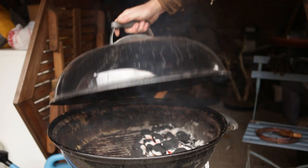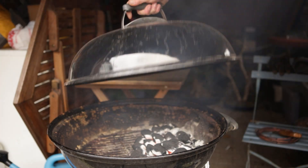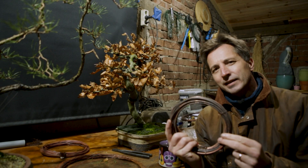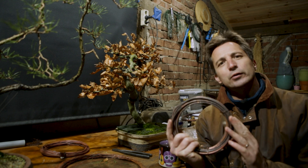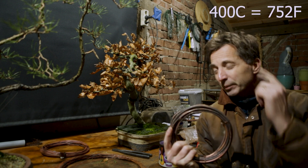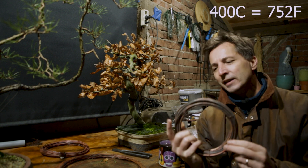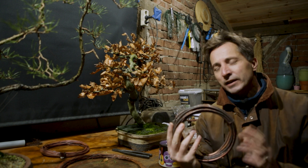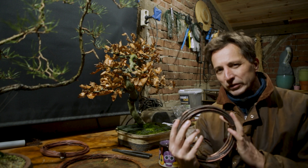I'm going to anneal this wire on my grill today. Now, to anneal copper wire it needs to be brought to a dull glowing state — basically from 400 degrees Celsius onwards, which is about 700 Fahrenheit. The conversion will start to realign the crystalline structure. Better is to reach up to 600 degrees Celsius.